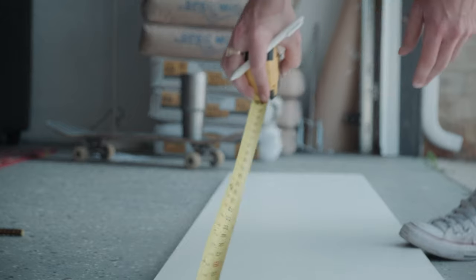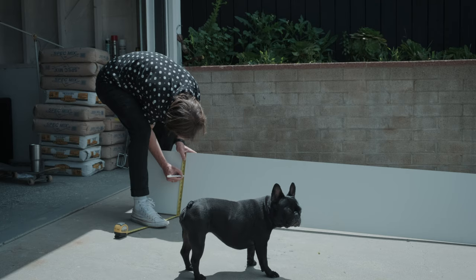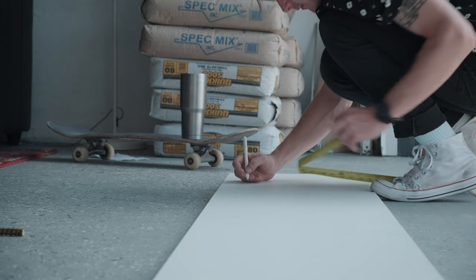The melamine is definitely a more high-end wood and you can use regular plywood as well, though it might be a little harder during the carrying process. The point of the melamine is that it's a nice smooth surface so there'll be less honeycombs. Essentially we're building this curb upside down, which makes it a lot easier to find the angle. Three inches at the top and about 6.5 inches at the bottom will give you a nice template for the perfect banked curb.